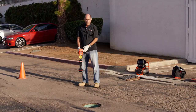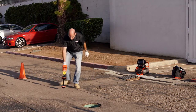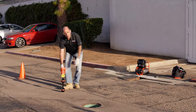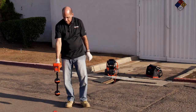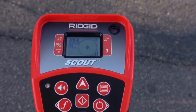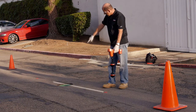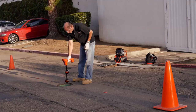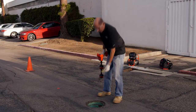We're going to center the first pole on the crosshair. For the best accuracy, we want the receiver close to the ground and we want to keep it fairly level. We have the first pole, so we'll drop an orange chip to mark its position. We know that the second pole is on the other side of the equator, so we'll walk past the equator and then locate the second pole. Next, we'll line the receiver up between the two poles and center the equator. The Sonde should be located at this point. We'd normally drop the yellow chip here to mark the Sonde's position.